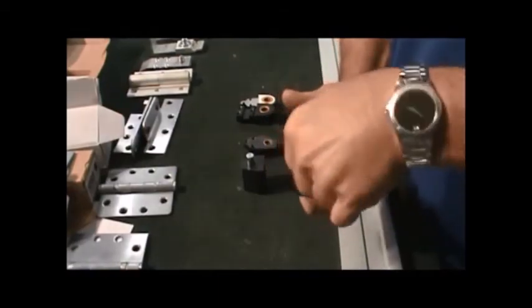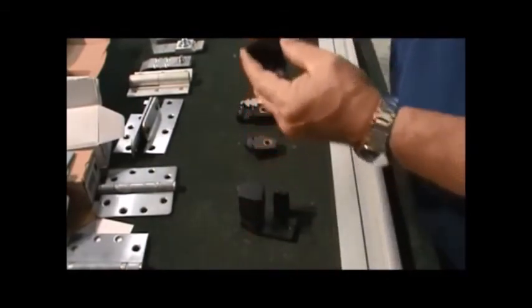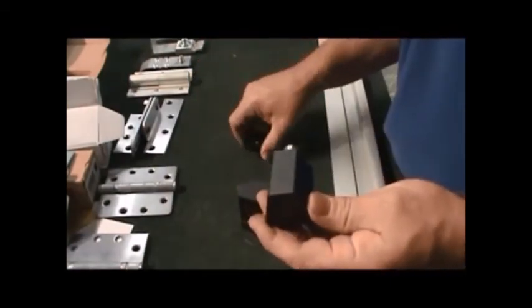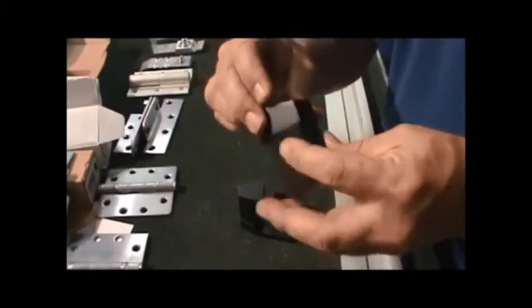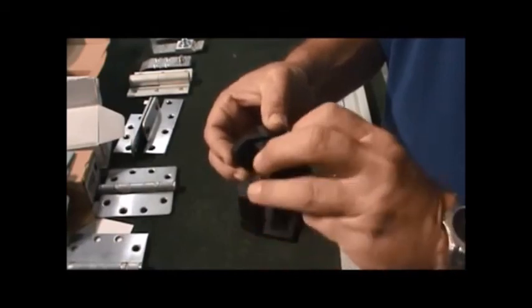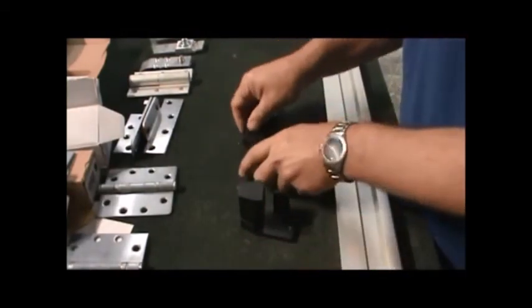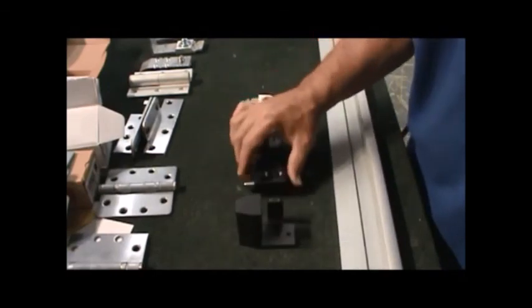So that rides on there. The weight of the door will pivot on that point, and on the top point you're going to see this right there. You'll be looking straight up at that, going, okay, this part right here goes completely into here, and it pivots in here, and this goes into the top frame of the door, and this is the top pivot point of the door. And that's just a quick rundown of how pivots work. To see more about the pivots, you'll have to look at the video on storefront pivots themselves. There's a lot to go over on pivots. Thank you.